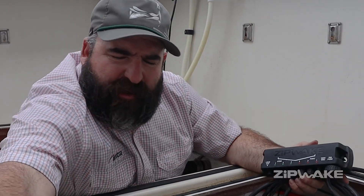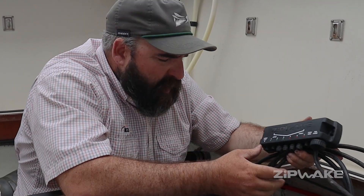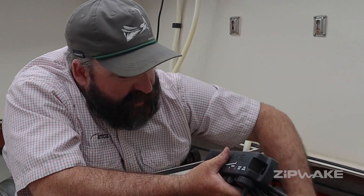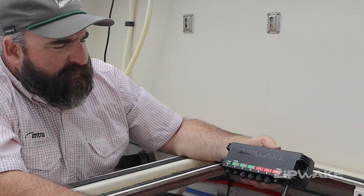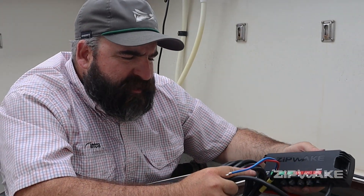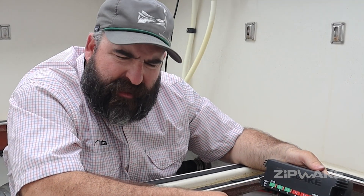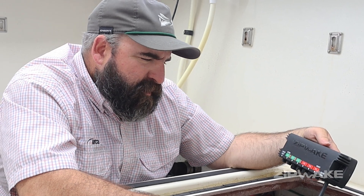The second step is swapping out your distribution unit. We've got the old one here — we've cut the power and negative feeds, taken our old servos out, and removed our IBUS in and IBUS out that runs up to your helm. We'll disconnect that and plug it back into the new distribution unit. The new pro distribution unit has a slightly larger profile but an identical screw pattern — it should fit right up on your old screws. There is now a built-in resettable fuse internally, unlike the old unit that had a push-style standard fuse under the waterproof cap.